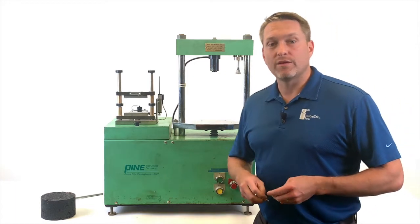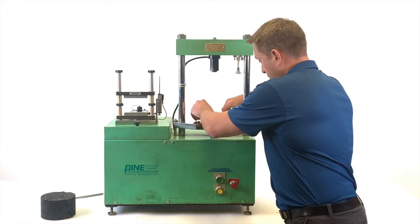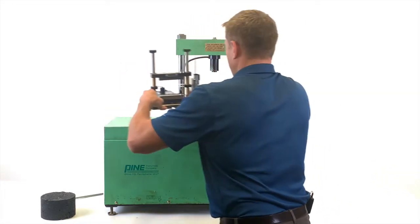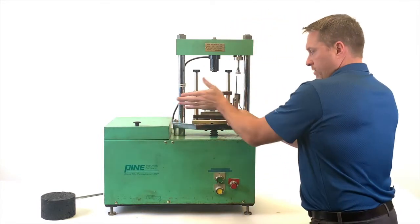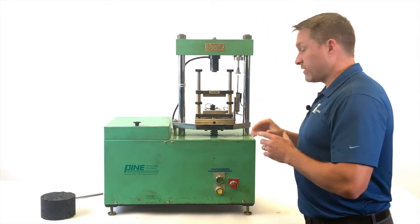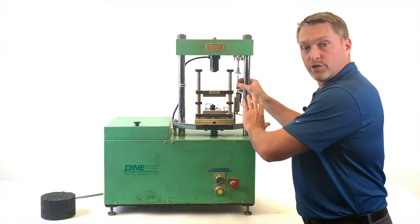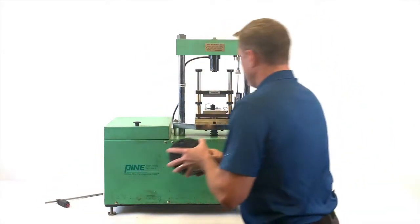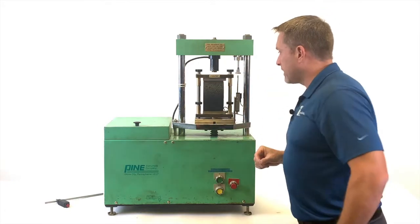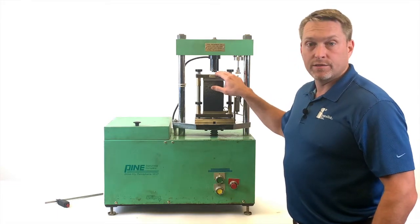In order to properly align version 2, you will need your spacer screws. Once those are screwed in, take your jig and back it up right in the middle. Again, you're going to want to keep this parallel. And also, for this version, you want to make sure that you give enough space between your contact magnet and your LVDT for the jig to slide in properly. Again, take your sample, rock it into the middle, and let it set. This will automatically make sure that the load cell and the middle of the spacer bar on top are properly aligned.